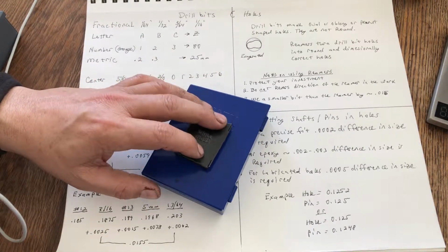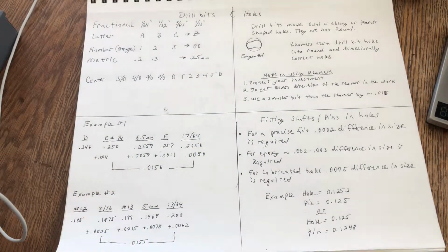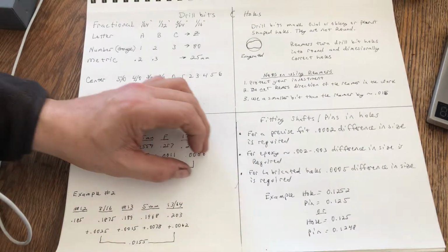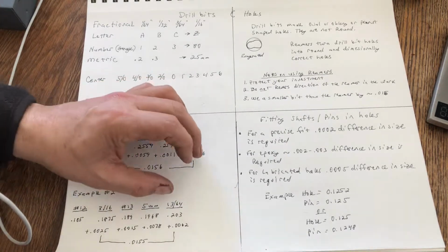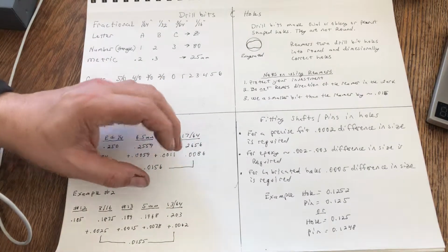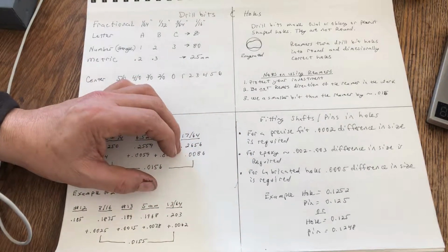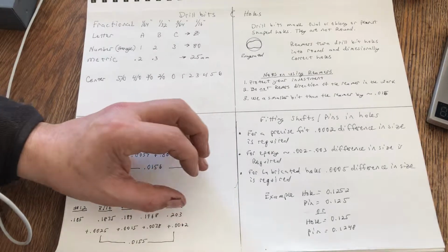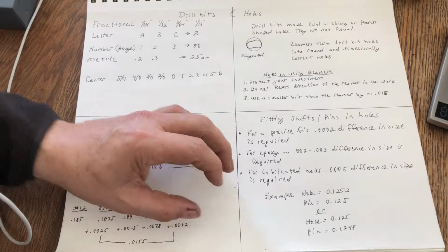Assuming you ever need to, you're going to have to invest in or build your own tool, and I'm just going to describe it here. I'm not going to get into the details. It's a chuck that's mounted onto a precision ground straight shaft, and then the straight shaft is inserted into a precision ground straight bearing, or should I say bushing. That bushing allows the shaft to move in a linear axis in a very precise and controlled way, so that when you push with your fingers, you're applying the force necessary to the drill bit to start and drill the hole.